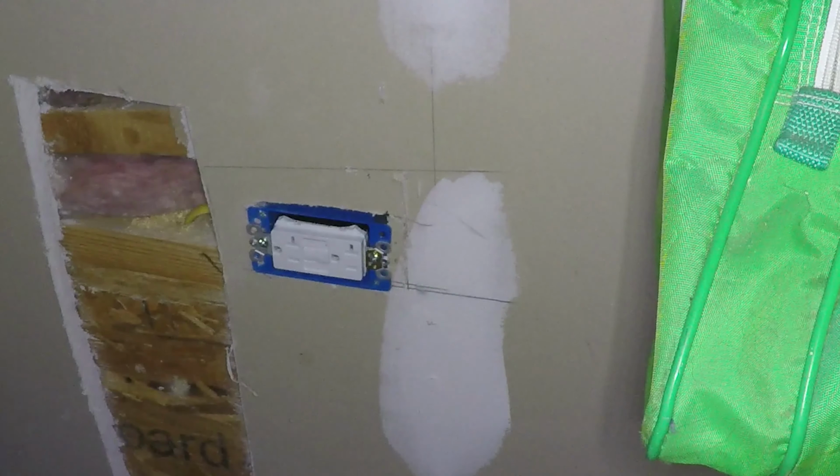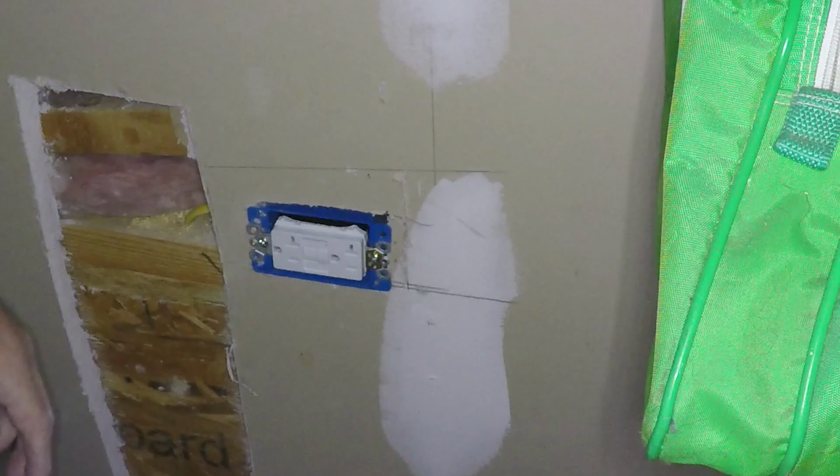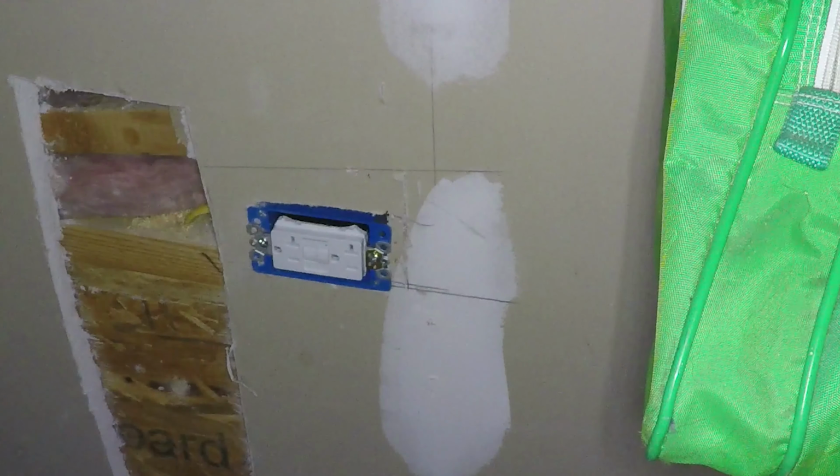Go down, turn on the sub panel breaker, then turn on the main breaker. Sub panel is the upper right breaker. It's off in the main panel. Got that first. And then go turn on that breaker. Call me on the cell phone when you're going to do it.